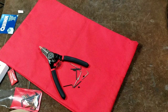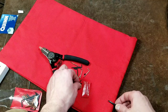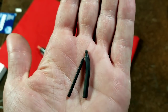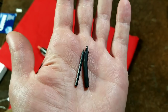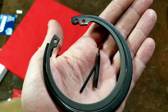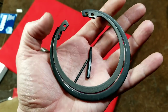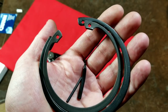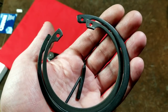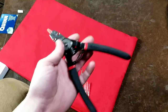It comes with a little pouch that holds all the bits. Just to show the size difference between standard and large pins — when you get a big set of snap ring pliers you get really large, strong pins. These are the kind of snap rings you use with large pins, and those other pliers are ratcheting. When working with snap rings like these, they can get outright dangerous — they have so much spring tension that if a pin were to break, these things would probably cut you.